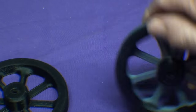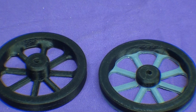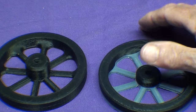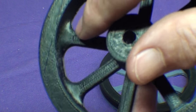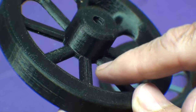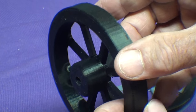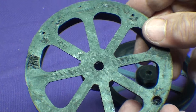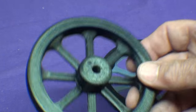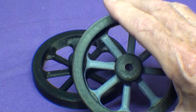Herb went the extra mile and made a couple more. He was printing these side by side two at a time using a different kind of plastic. This is also an 8-spoker but with a much smaller hub and quite a nice radius in there. Using my little die maker's square, I can see there is taper — pattern draft — on the hub as well. This process is called rapid prototyping, or now 3D printing, and you also have to be able to do CAD drawing to do this.